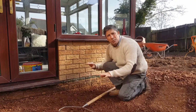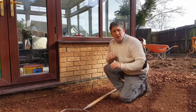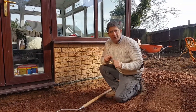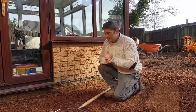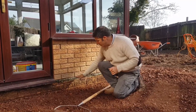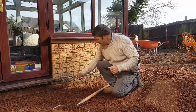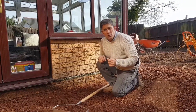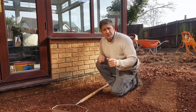By the time it compacts that'll be a suitable depth for us to lay the slabs. It's so important you check your levels — go over it, make sure you've got a fall away from the house. In this situation what we had here before: the patio was level or someone had the patio level up to that course. So we're going to follow through with a few more videos on preparation and sub base.